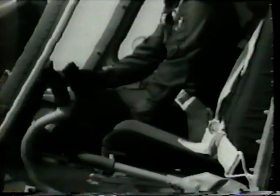Now check freedom of movement of flight controls by pushing the tail rotor pedals back and forth, checking for any binding and pedal movement. Release both cyclic and collective friction. Move cyclic stick in a circular motion, checking for any binding of cyclic controls.